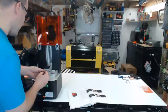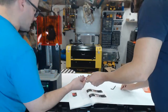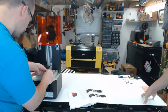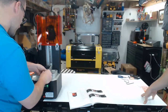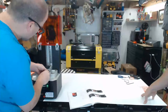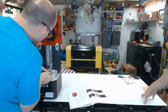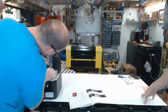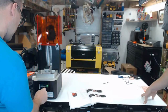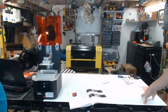Tighten the small screw on the cantilever with the Allen key. This one's too big. Okay, that's why I'm going to tighten this. Some SL1 printers may have two screws. That's why we didn't tighten it earlier, so we can get it perfectly 90, or as perfect as my eyes show. Okay. Measuring tilt times. It did not say to close the lid, so.